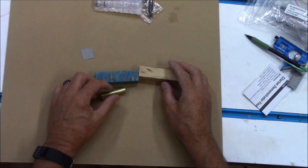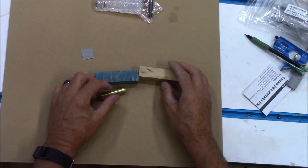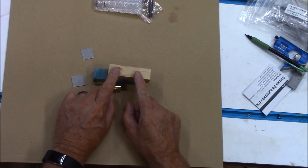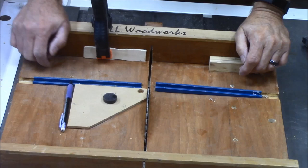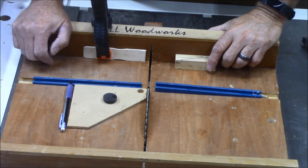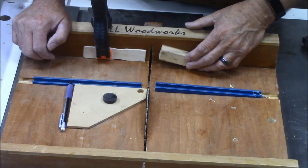I will first cut two one-quarter inch sections off of this blank. I've got a stop block set up right here to give me my quarter inch. Using my segmenting sled — if you haven't seen the video on how I made that, I think there are a couple of videos on me making it. It's very functional for segmenting. So we will cut two quarter-inch slices.